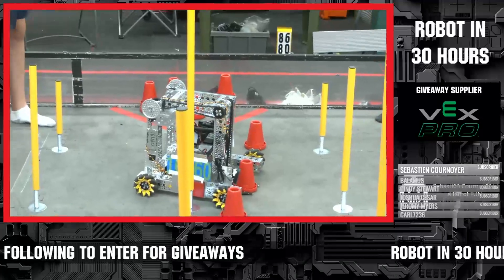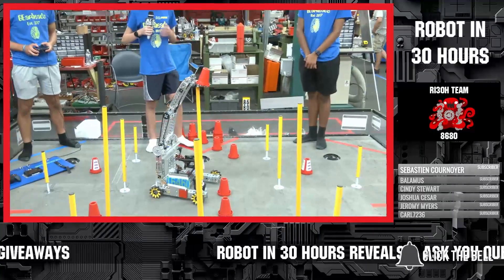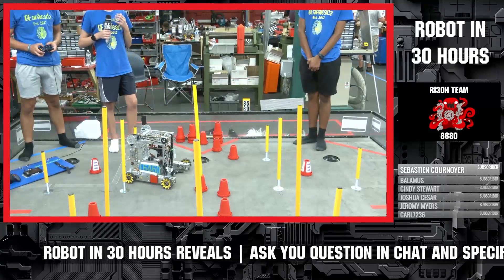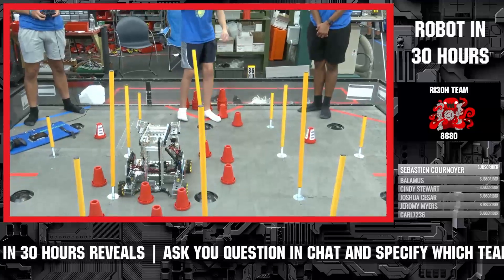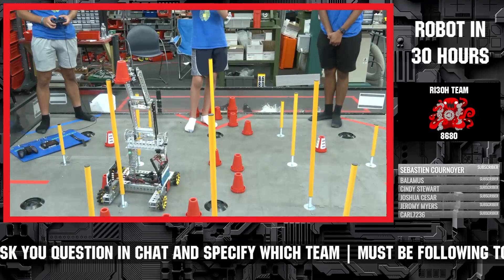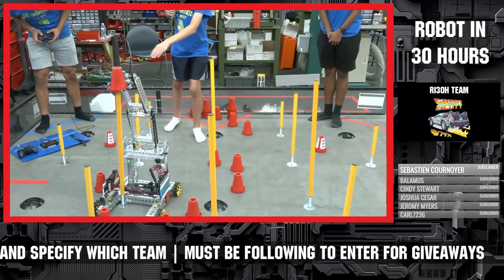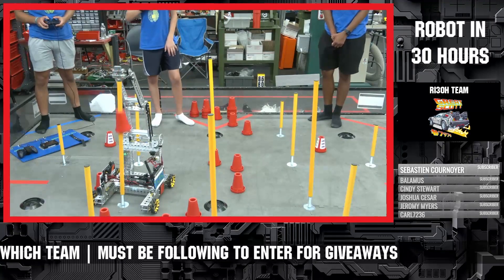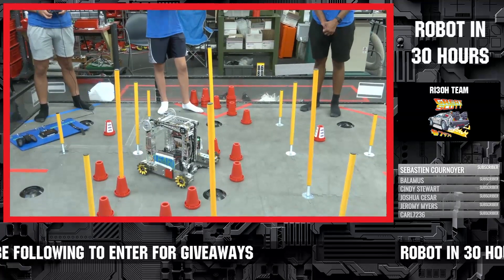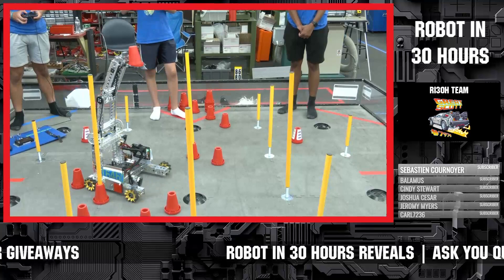When we started the iterations for the design, we first started by drawing out a bunch of plans. Although we weren't thinking extremely clearly back then, we tried to minimize the amount of resources and the time it took to build the robot. We came up with a design where there were three servos on an arm, and each link of the arm could all move. That was supposed to maneuver the arm to drop the cones on each of the poles. But we quickly realized that plan was terrible because it took way too much programming, it was not strong enough to hold its own weight, it was very unreliable in autonomous, and it was just an overall bad decision.